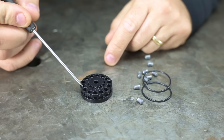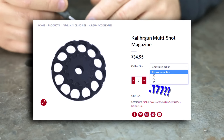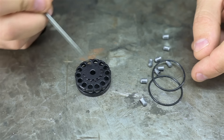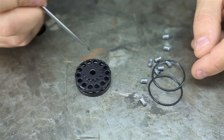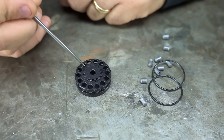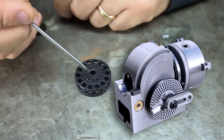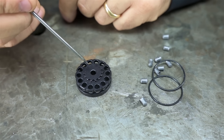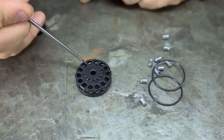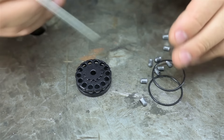If you're wondering if I couldn't just buy more of these — first, you're in the wrong place. And second, no, I can't. They're nowhere to be found; no stock left in the size that I need. They're almost an inch and a half in diameter and pretty darn close to half-inch thick — 14 holes, the gear feature, some divots around the perimeter, and the groove for the O-rings. Nothing I don't think we can't do. If we're making just one, this wouldn't be too much of a challenge for a manual mill and a rotary table — or a dividing head to get 14 accurate divisions. But since I want to make two and I'd like to hold onto my will to live, we'll do it on the CNC. I already have bar stock that's pretty darn close to this size, so let's head over.